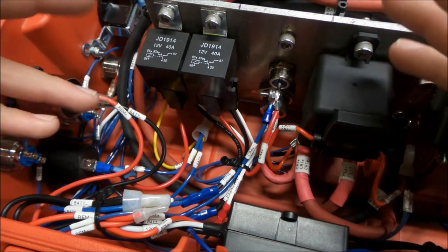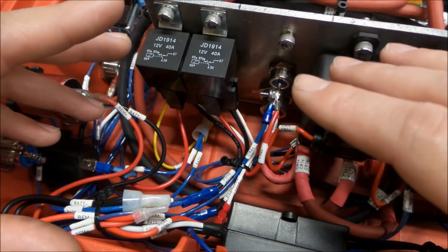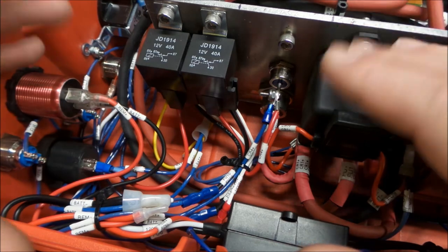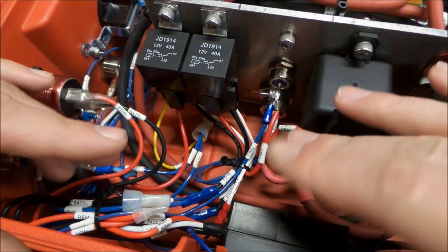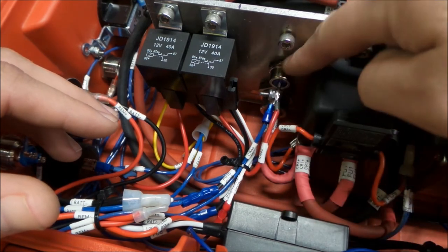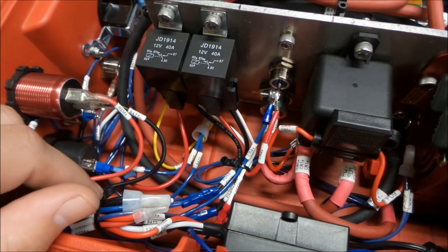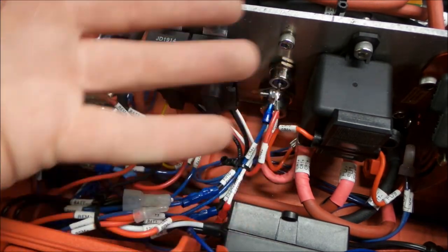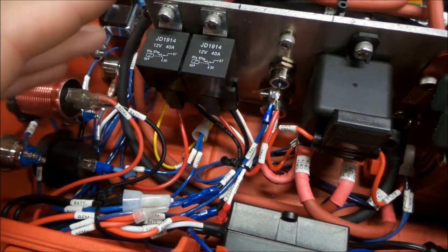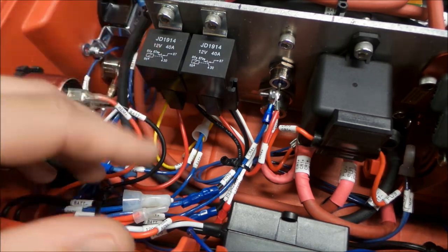So it was a fun thing to learn about, and my rule of thumb basically was I just went overboard on the available current that these things could work with. If I expected, like this one, a 20 amp draw, so this is a 50 amp rated diode. And again, everything's heat sunk. They're not going to really get hot because they don't see constant current. It's only, you know, briefly, but it's kind of neat to put that in there. It was fun to play around with, a neat thing to learn about.